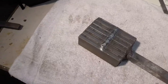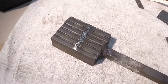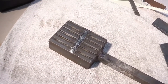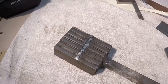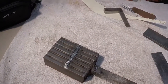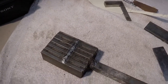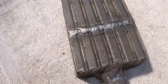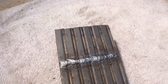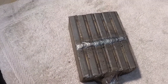And I keep aiming at this little block of Damascus here that I'm gonna weld up. I'm going to put it in a 2,300 degree propane forge. It's going to get real hot, and I'm going to stick it under a power hammer and a hydraulic press, and all these layers of steel that you see here are going to become one piece of steel. They're all going to bond metallically.